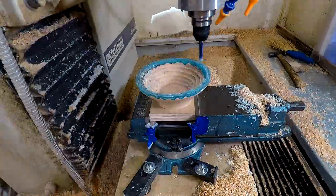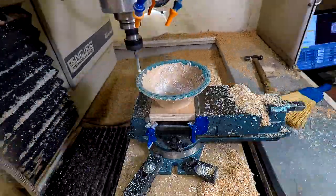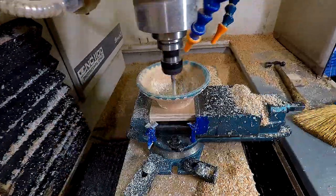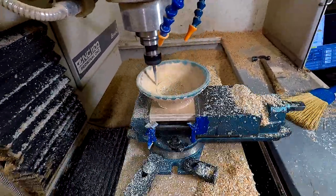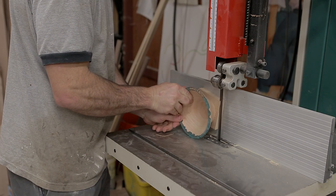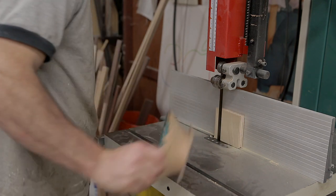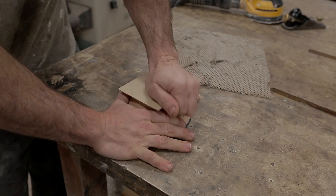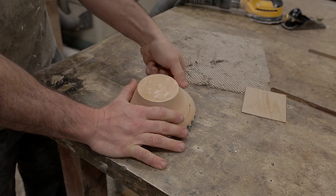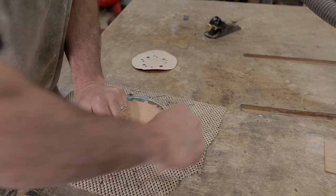It's good to have a vacuum or air to get chips out, because I've had issues where the bit got stuck and actually pulled the piece off my table when I forgot to turn on the air. Use caution here — maybe don't use large step-downs. Start with small step-downs like 100 or 150 thousandths of an inch to avoid potential issues. Once the machine is finished, I bring it over to the band saw and cut off that bottom portion of plywood, leaving just a little sliver on. The heat build-up often reduces the adhesion of the glue and I can pop the bottom off.